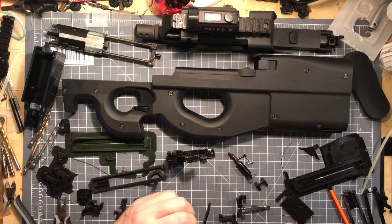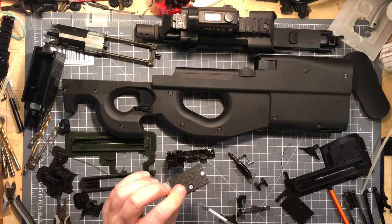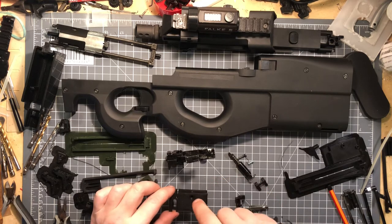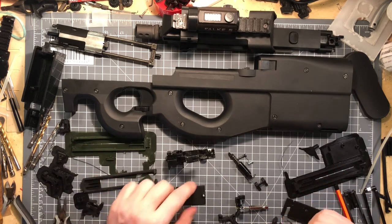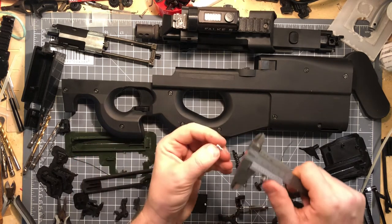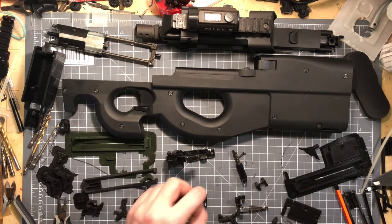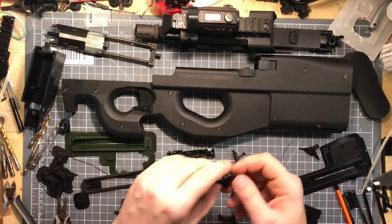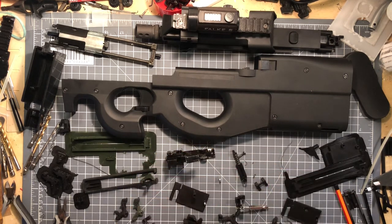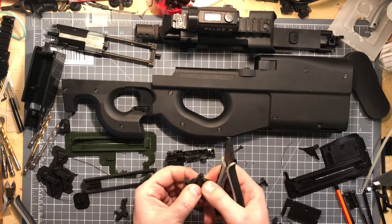I use a small printed part here so it doesn't collapse. I just screwed this off to show you — in reality I could pretty much print this in here. I usually print the parts first to check if everything fits. I've got a normal M3 by 16 screw in there. If you want, you can close it up all the way with another screw from here but I usually don't bother — it's not needed. I've got some small countersunk screws, I think they're eight millimeter long countersunk M3 screws.